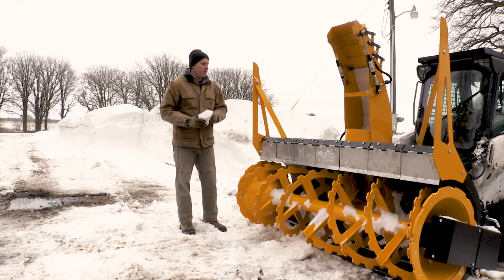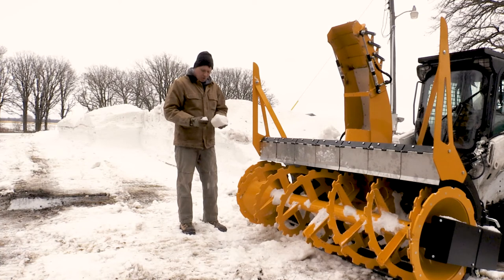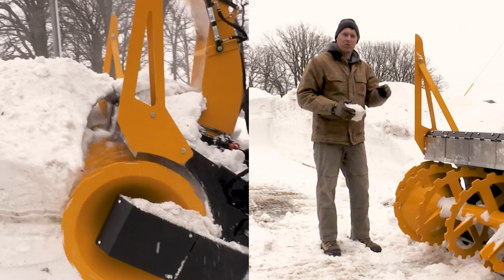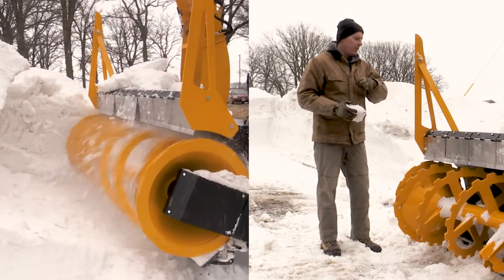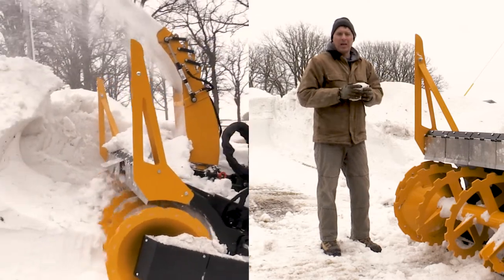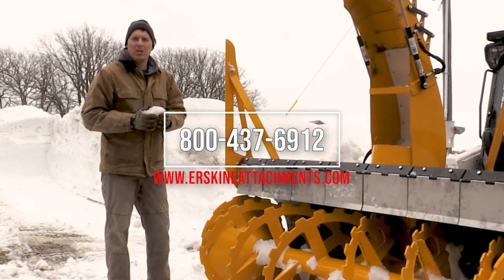I was very impressed with how it handled the snow pack here. This pile is up to six feet deep and has probably at least four layers of different snow blown on top of it over the course of the winter — the snow itself is basically like ice, very dense, very heavy, and very hard. It took a lot of effort to cut something that deep; you had to take multiple stair-step cuts. But as far as cutting ability, the auger works terrific — it chews up the hard snow without hesitation, and the fan with the piston-driven motor works tremendous to keep the snow moving. Check back as we continue to make more videos like this, and give us a call or check out our website if you have any questions.